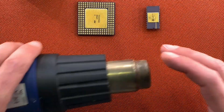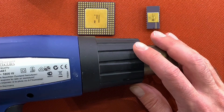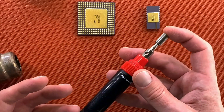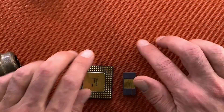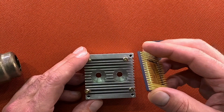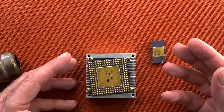For the CPU I'm going to use a common hot air gun which you can buy in any do-it-yourself store. It's important to heat up the CPU slowly, otherwise you might crack the ceramic from stressing the material too much. You could also use a small gas torch, but the temperature of the flame is much higher compared to the heat gun and you might destroy the die with too high temperatures. But if you don't care about functionality, you can go with the gas torch — it's much faster. I always use a heat-resistant material on my table and something to fix the CPU in place. When you reach the target temperature you can't touch the CPU anymore and you need to act quickly before the solder gets hard again, so I use an old heat sink with some screws to hold the CPU in place. Simple equipment which everybody has available at home.